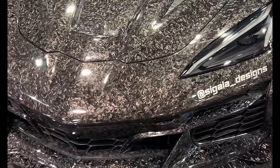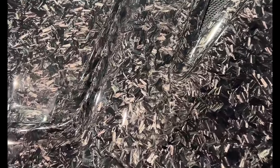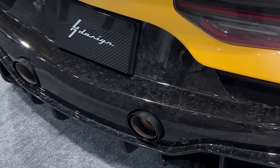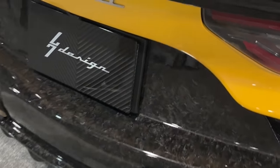Not that forged bullcrap. Sure, sometimes forged carbon fiber is neat in small parts here and there, but it has gone way overboard — it's like a garnish next to a nice dinner; you're not supposed to make the whole dinner out of garnish. I always think it looks like those old fiberglass cafeteria trays from elementary school. It's not really forged — it's not increasing the strength of the part through compressive stress or changing the microstructure. It's just scraps of carbon mashed together with resin, basically the cheapest method of making fiberglass but using carbon. It's not that cool. But I digress.